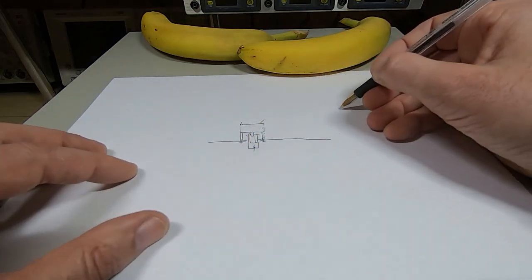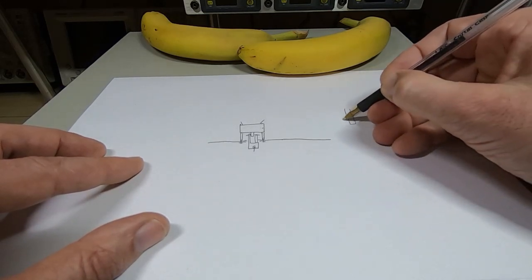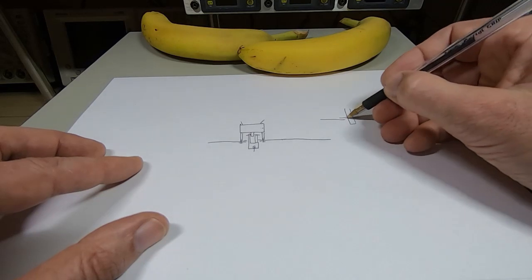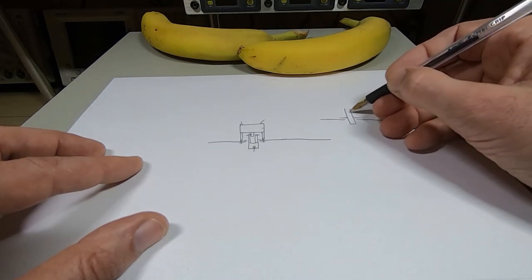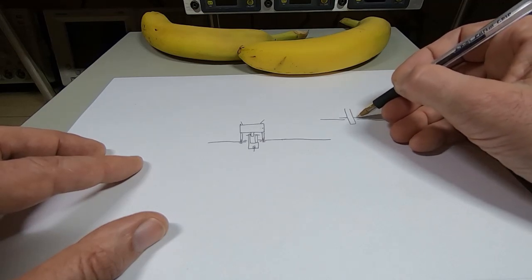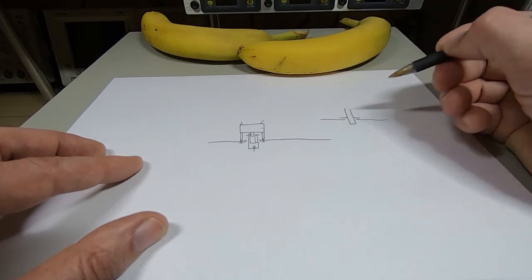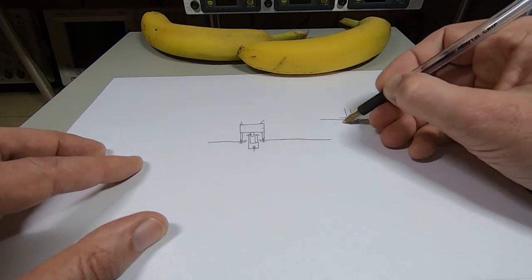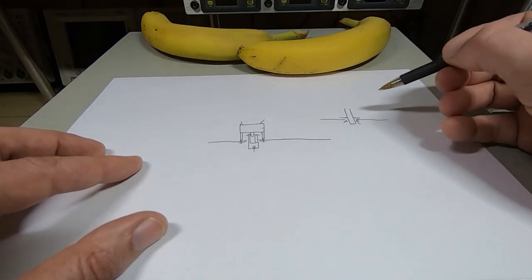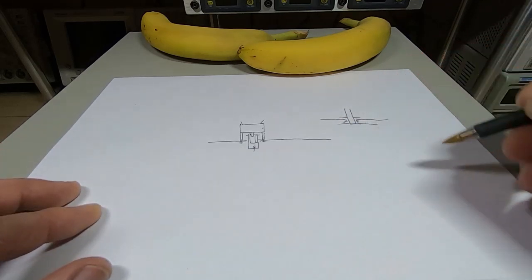So it's quite difficult to explain, but if we say this is the shaft from the motor, and this is the hole that's in the top of the chamber, then there's a fibre washer that just sits loosely. It's a relatively tight fit on the motor shaft. It's not a push fit, it's just fairly snug, and that turns mostly with the motor shaft, but it's free enough so it can just fall down onto the top surface of the chamber, and it effectively seals this hole to stop air blowing out, and that's mostly to protect the motor rather than to affect the profile. And then of course the fan just sits on the bottom here.